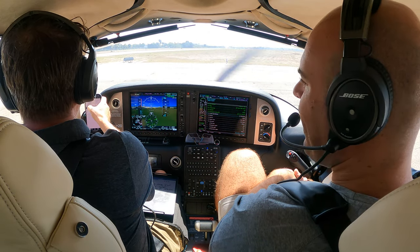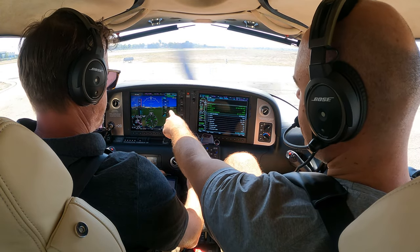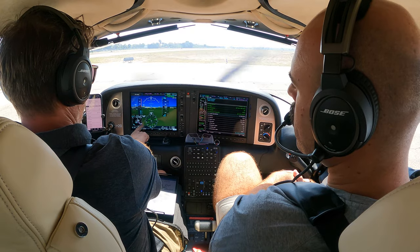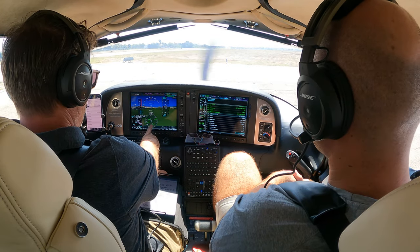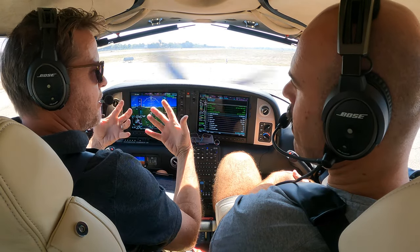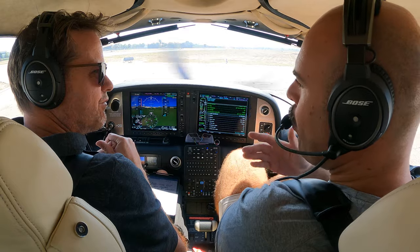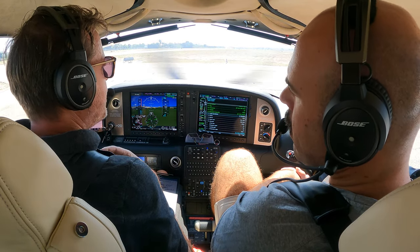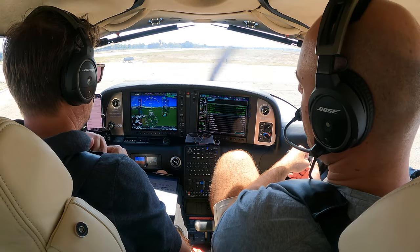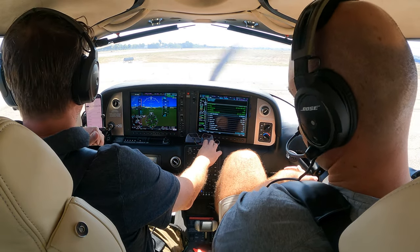What if you're standing in a run-up area and there's a blast pad or a metal thing behind you for the jet blast at an airport, and all of a sudden you see on your HSI that you don't see any numbers? What could that be? What could be interfering with something, and what's that thing? Well, obviously the jet. But if we're gunning it, maybe the jet blast. There's no plane or jet blast. There's just that big metal pad behind you. Oh, so there's no plane there? I didn't know this. I assume it's going to have some interference with your magnetometer. Interesting. If you have that, all those numbers go away. Okay. So just taxi away from it. First time I ever heard that. See what happens. Okay, cool.